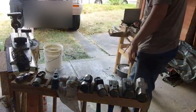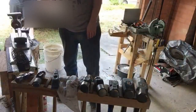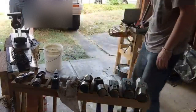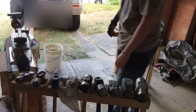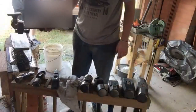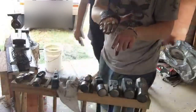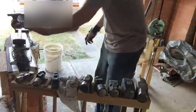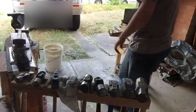I've got two anvils. The anvil on the right, this one, that's a 20 kilo cast anvil, solid cast iron. It doesn't have any welded face on it. It's got a square horn, London pattern style. This one here is two railroad tracks side by side with forklift tine over the top of them and the end shaped into a nice round horn. And that's about 40 kilos.